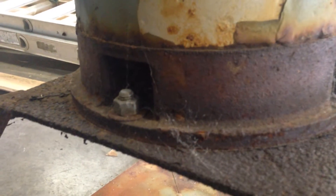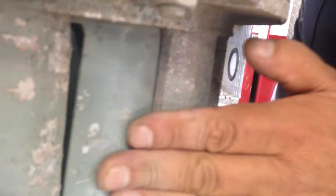The problem is in this casing here, because when we picked it up, this started to separate. See this right here — this blew out right here. You can see it's kind of rounded right here, and this isn't lining up like it probably should. If you look at some of the others, you can see the edging is pretty good, there's a little bit of a bevel — that's kind of normal. But look at your bolts right here — they're all disintegrating because of the salt air.